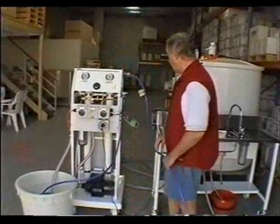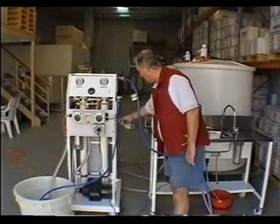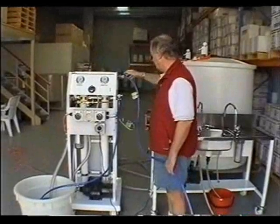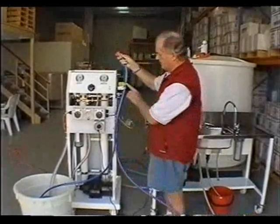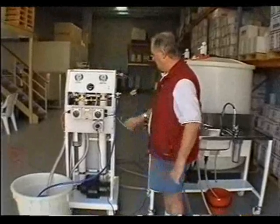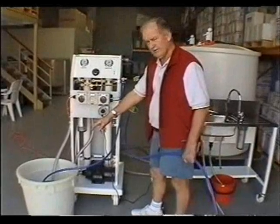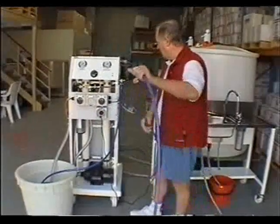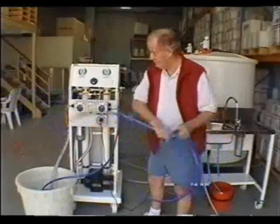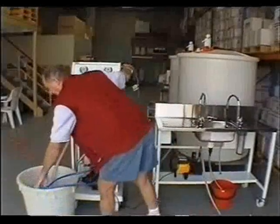So just to go through that again, the incoming hose is initially disconnected and the plug is put in place. The product water hose, the clear hose to the water tanks, is disconnected, and this drain hose marked with the yellow and the white tag is put in place. The reject water hose is coiled and put into the 75 litre washing tank, and the small hose from the top outlet is also placed in the 75 litre tank.